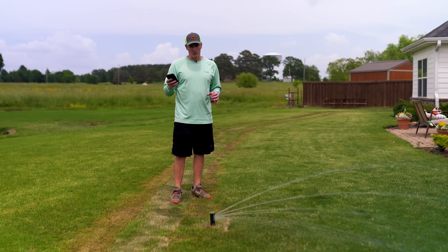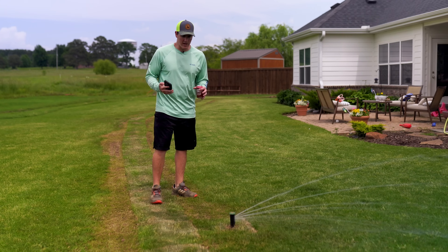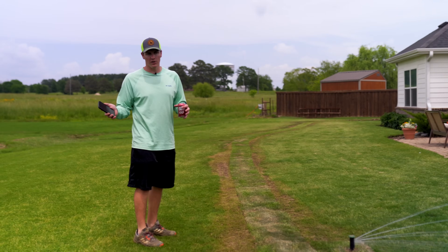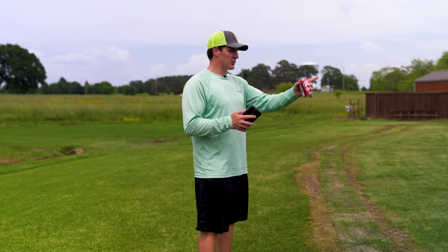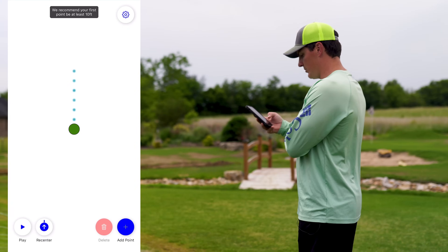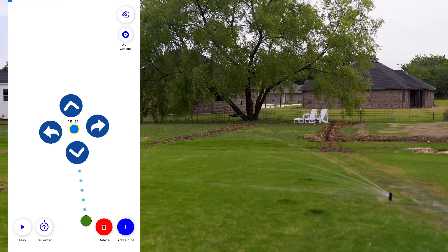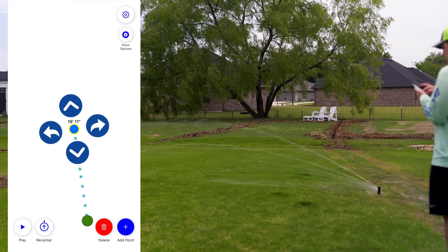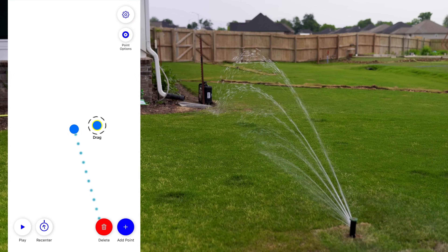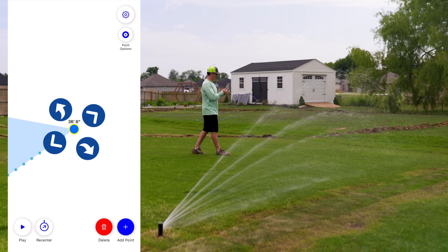then I push program, and I can go in here and tell it exactly what points I want it to stop at and how far I want it to go. I have my little map of my sprinkler program, and basically all you'd want to do is just map it out to the edge of the yard or the edge of where the other sprinkler head is going to match up, because they would be in a straight line. We put in our first point, add point, and since it just chose that direction I'll start there. We'll go to the edge of the flower bed — that's about where I want it right there. So that point is set. You add a new point and drag that one over to where it's going to go. Super simple, super intuitive.